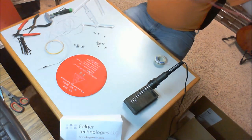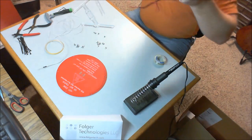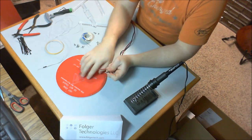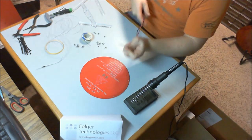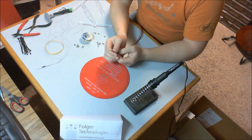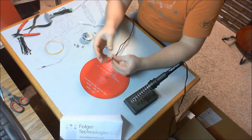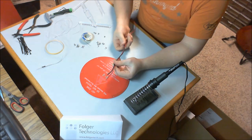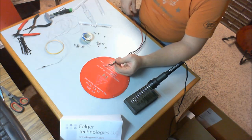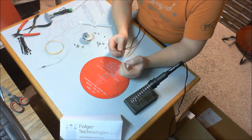So we have a good length of wire here. I'm not going to cut it yet, because I'm going to solder these two ends to the heated bed. I'm going to leave them long, and once I figure out the run that they have to make, I'll cut them to length, which will give me maximum length for the other use of these, which is to go from the power supply to the ramps board. So this one length of wire at the moment has two purposes, and I'll have to cut them down when that time comes.